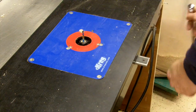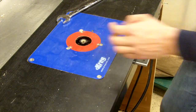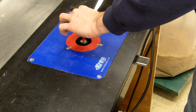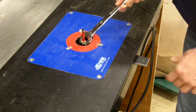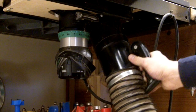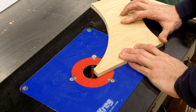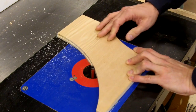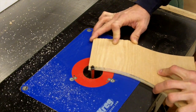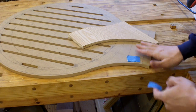I've taken the opportunity to show you a feature I really like on my router table that's on the wing of my saw. You can see how I have that wrench positioned so it's gripped by the angle iron at the side of the saw. I also have the dust collection set up so I can adjust the height of that router, and the dust is all pulled to the side — not through the brushes of the motor. It's a really nice, easy-to-adjust setup with no cabinet to collect dust. Very cheap too.